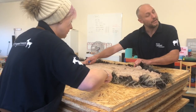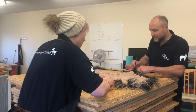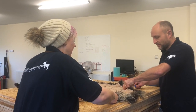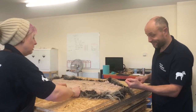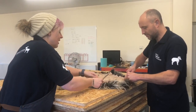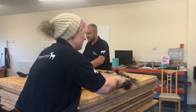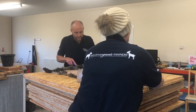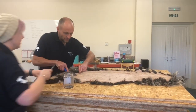It's quite tricky because they're not flat animals. With a goat skin you can tell it's a lot harder to get flat. There isn't really a way to flatten out curls later on — you want to get the pinning as accurate as you can. With goat skins and things like that, you've got to make sure that when you're stretching it you stretch it in the right direction for the hair to go in, otherwise it can be really bad. More hairy skins like goats and deer are more critical for stretching, whereas sheep have enough wool that you can trim it later, and because they go through the combing machine as well it gets really nice.